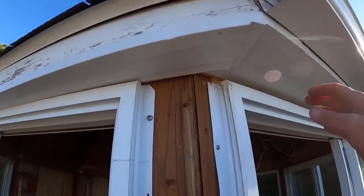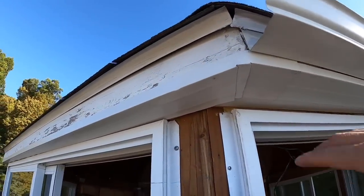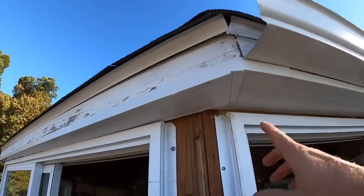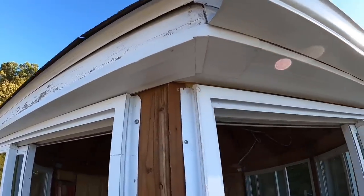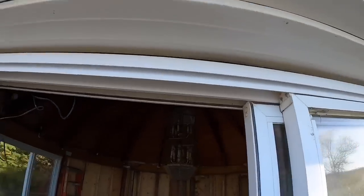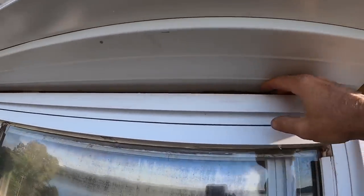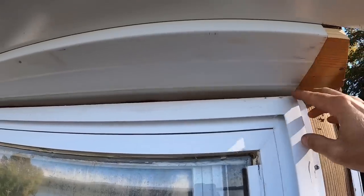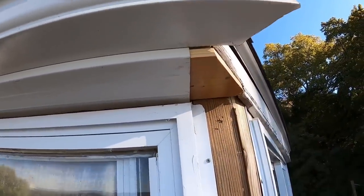We've got our 6 inch piece tucked underneath of our 4 inch piece. Yeah, this looks a little janky here, but with the way these boards come together, I had to double cut that. And again, the weather comes from this way, so it's going to blow right across it. Got our six inch piece in here. We did have to trim it slightly because it's a little smaller over here, and a lot of people might ask, well, why'd you leave this little section right here?